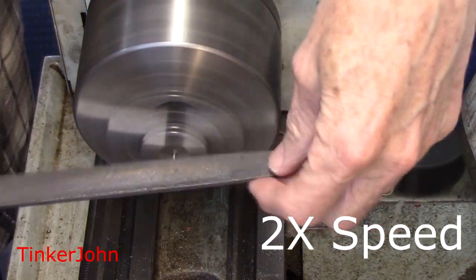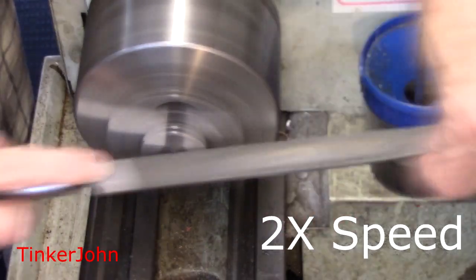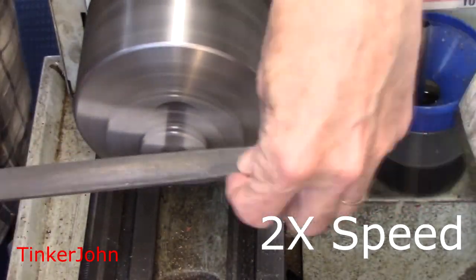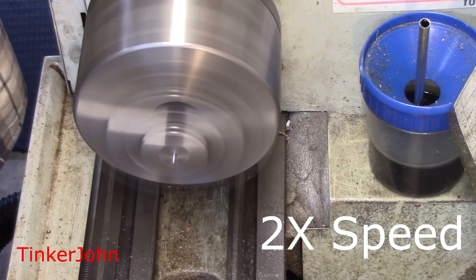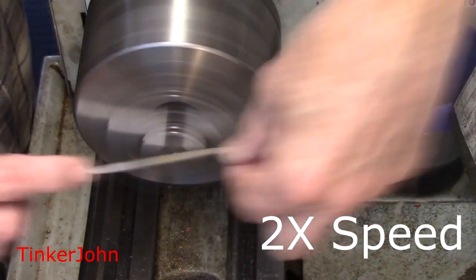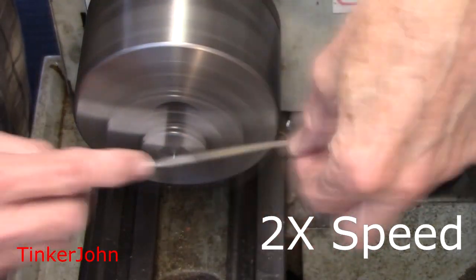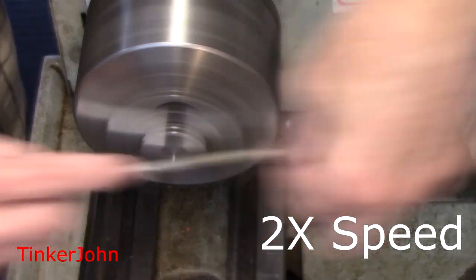I'm going to take a look at how I made that needle. I've got a 2-56 machine screw chucked up in there. I cut the head off of one end and I'm using a file to put about a 15 or 20 degree angle on it — I forget exactly what angle the plans called for, but you can check your plans. Then I go back over it with a small needle file and make it as smooth as possible — that's how I made the needle.